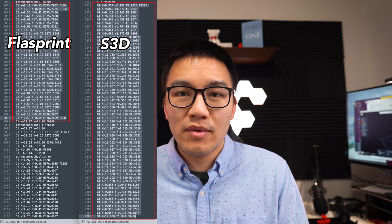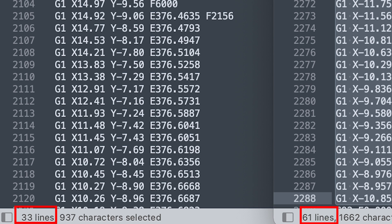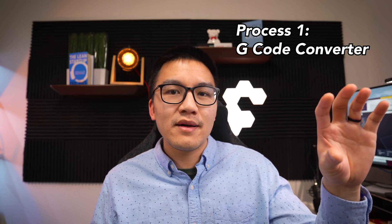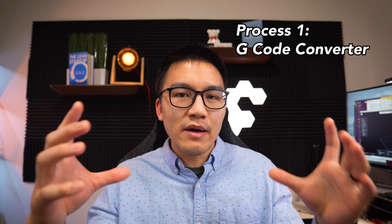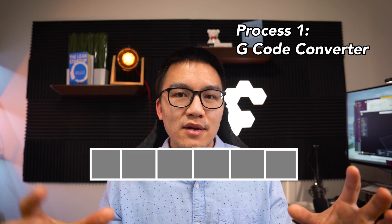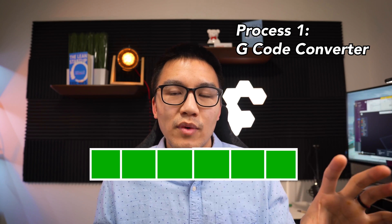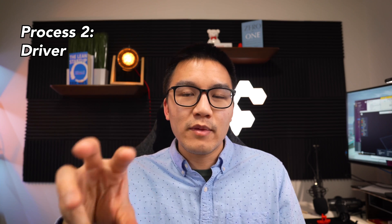The root cause of the issue actually goes into the G-code. The G-code is not completely wrong, but if you look at the number of steps it takes to complete one circle ring, it's twice as long in Simplify3D versus FlashPrint. As an engineer, it clicked — knowing what's going on in the G-code and how the firmware reads it. The machine is executing code into the buffer faster than the buffer can fill up. To explain simply: imagine your 3D printer controller is made up of two processes. The first takes lines from the G-code file, converts them into machine code, and loads them into a buffer — essentially a queue with a set number of slots. Once the buffer is full, the first process has to wait for a free slot.